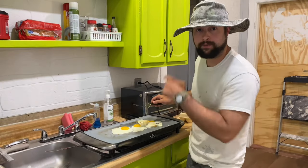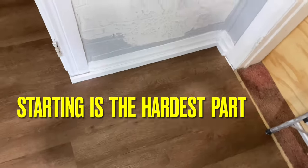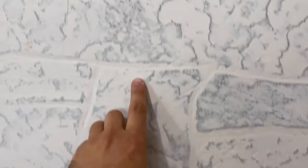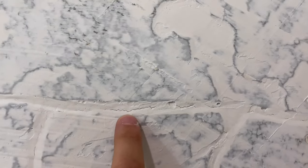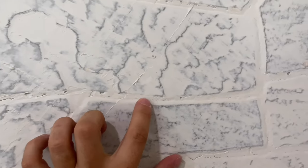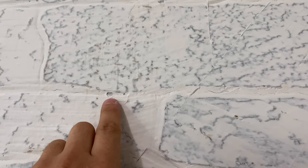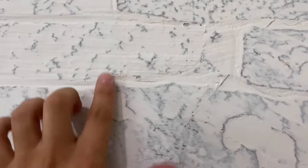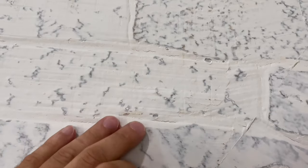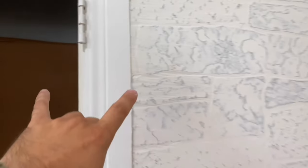It's going to take a while to dry. Okay, it is day two. You can see the floor is clean and it's all dry. There are little cracks inside the cracks — that's going to be just fine, that's normal. There are indentions because overnight when this stuff dries it sinks in a little bit. Where it was thick inside those cracks, it's cracked in almost every single one. My little waves are very small — if you have big clumps sticking out, you'll want to scrape that off. Before I start muddying a second time, I'll take my mud knife and scrape any little high spots.